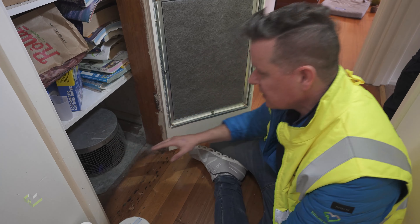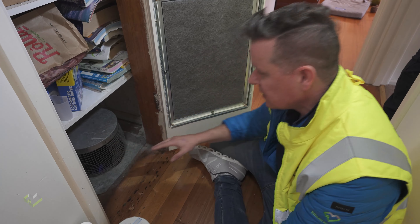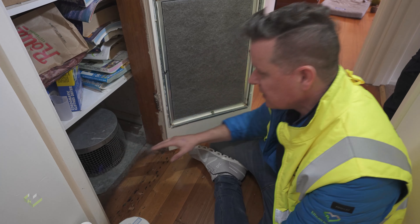This is another perfect example of a ducted heating system return — we've made numerous videos about how leaky these returns can be. But in this situation where we've removed the ducted heating system, everything stays as is and nothing gets remediated to be airtight. So we're going to pull this out and reinstate an air barrier so that this cupboard is now airtight and won't be cold and start growing mould. This is basically a hole directly through the floor — a place where rats and mice will definitely reside — and we need to reinstate an air barrier to get this cupboard airtight.